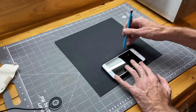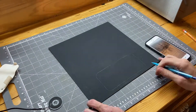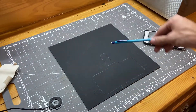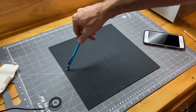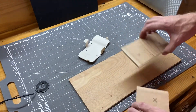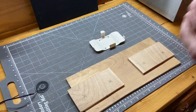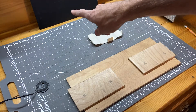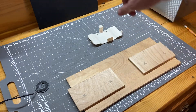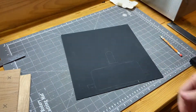I did a basic outline of the phone shape, making sure to leave enough material for the tab, then cut straight across to get my basic shape. I've got some quarter-inch plywood, and I basically need to recreate the mold from the old holder — position and glue the pieces down, then cut the kydex out, heat the center section, press it in, let it cool, and do the final shaping after that.